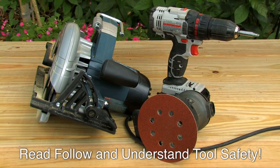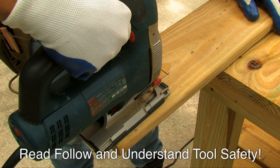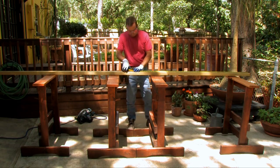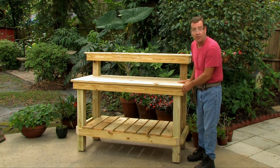The tools you're going to need are a circular saw, a drill, and an orbital sander. I will be using a jigsaw for a short period, but I'll show you options if you don't have one. We're going to start by cutting out all of our pieces and parts, beginning with our two-by-fours. Always cut your longest boards first.